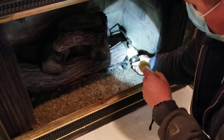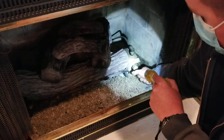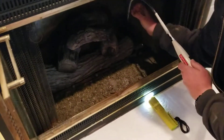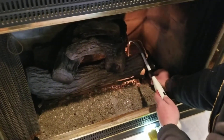When that white line is up and down, it's off. Turn it to the left where it's facing left, strike your match, push the big button in, and then you'll light your pilot back here.